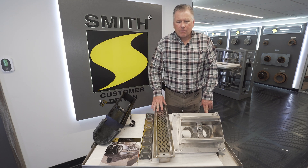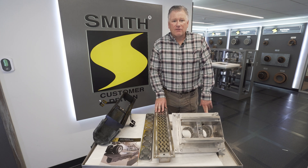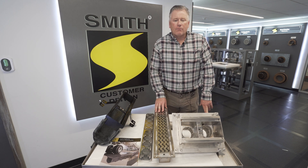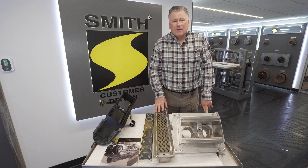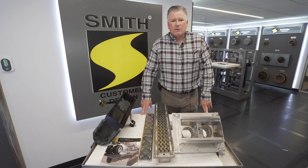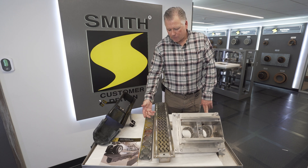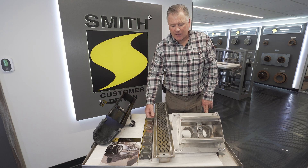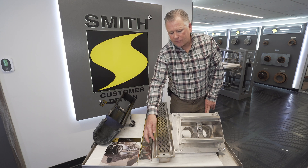One other item I wanted to cover: any trench drain in above-ground floor applications should always have a waterproofing flange and membrane, or at least a waterproofing flange, just to pick up that nuisance water — because concrete will separate and crack away from the trench drain. This is a flange without a membrane clamp on it.